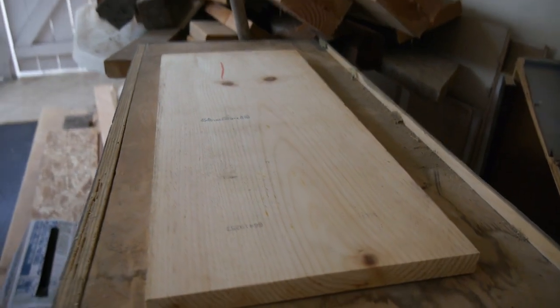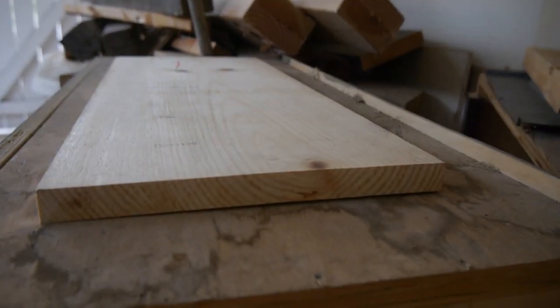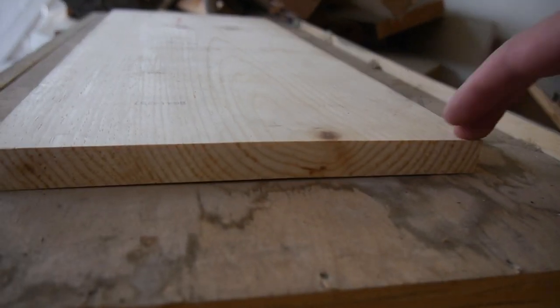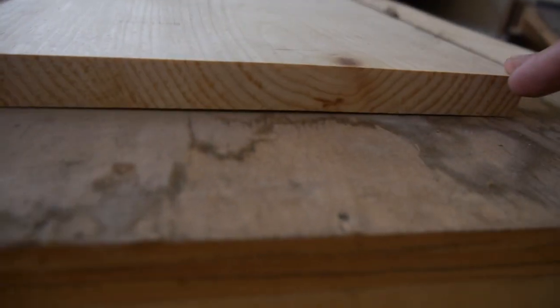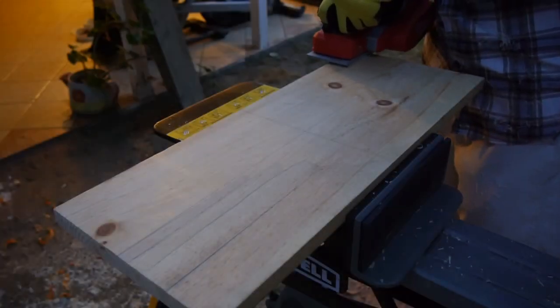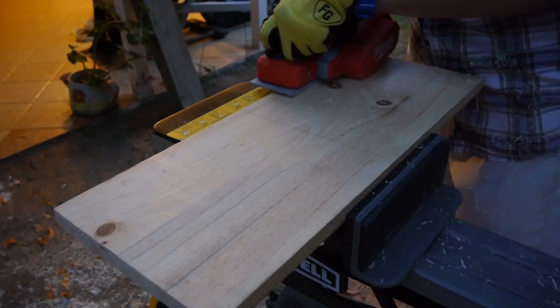Over here I have a board made of pine that I've had for a while and as we can see the board is quite warped. It doesn't sit exactly flat on the surface as the board is curved and one of the ends is lifted off the ground. All the other three corners are touching, so I use the M18 planer to shave off the high spots on the underside of the board.